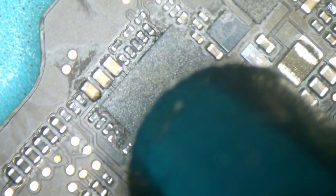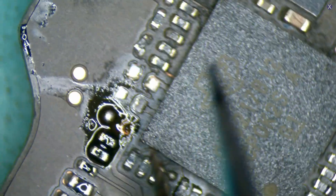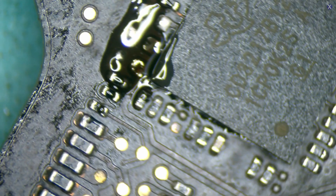Okay, looks good — that's much better. So we can see why this was giving a problem: the pad was damaged there. The other two pads don't look to be as bad. The top one probably was actually good to begin with, but this bottom pad definitely has a problem. I'm going to recreate that pad and also recreate this one. We're lucky because the surface was still pretty good, so we wouldn't have to build our own — it looks fine.